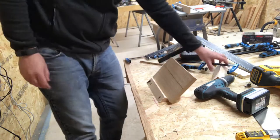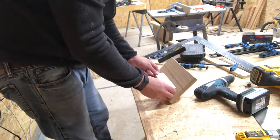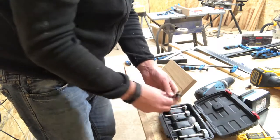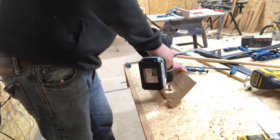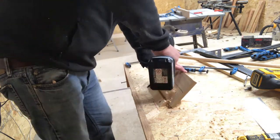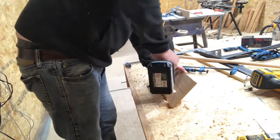I then took another 45 degree angle piece of redwood and held that on top of the oak board, before taking a 3/4 inch Forstner bit and drilling through that flat redwood scrap and then down into the oak board set on the 45 degree jig. Make sure you clean away all your debris so the drill bit doesn't bind in the piece. Also, by using the jig it prevents tear out.